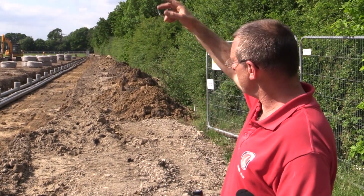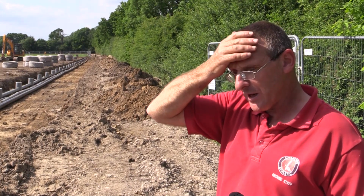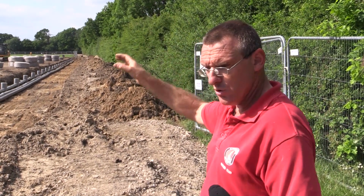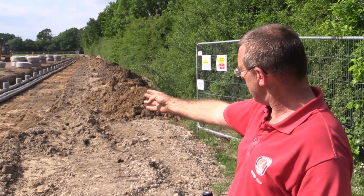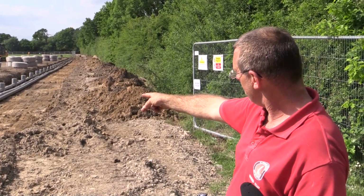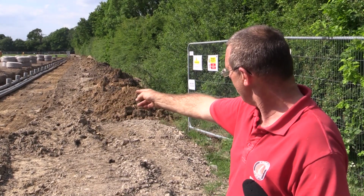which is phase 4, when we do the old South East Counties pitch, the old pitch 1, where most anyone that's visited the training ground to watch the 18s game is our match pitch, which most people know, and the pitch behind that, pitch 2, which obviously we need to keep because we need to function at the early part of the season for the pros. So we have the lateral collector drains into the pipe, then we've got the irrigation main next to it, then the drains for the new phase, getting ready because we don't want to dig the ground up again, that's just daft, and then the irrigation return, which will send it back to the lake.